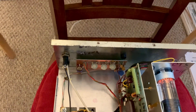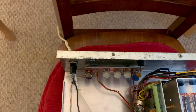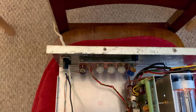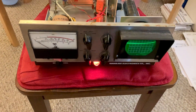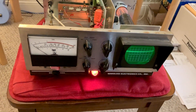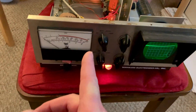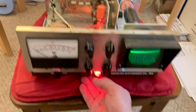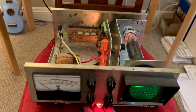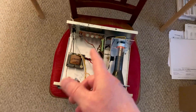There's really no reason why this thing won't work all the way down to DC. It's designed to work close to 30 megahertz, but there's nothing there to keep it from working on all the lower ham bands down to 75 meters — this thing will work on all the bands. I mainly bought it for my 10 meter setup, but I'm not going to do any more work to this now. I'm just cleaning it up, going to put the lid back on and wrap it up and put it away for now.